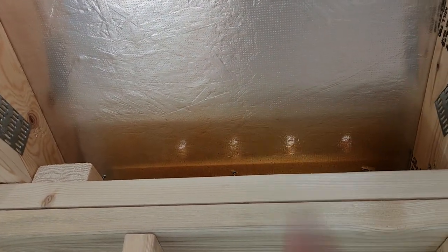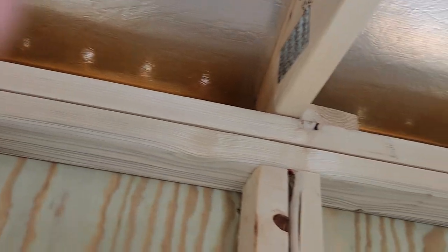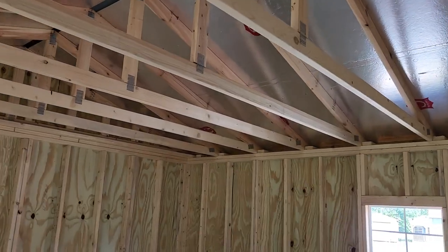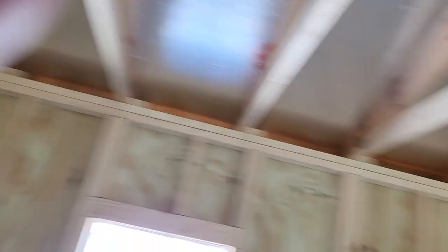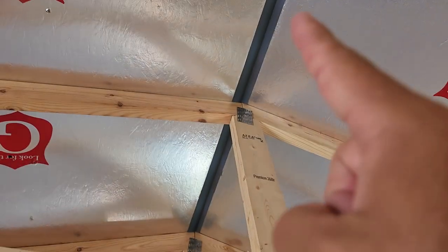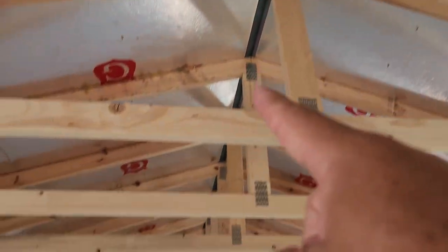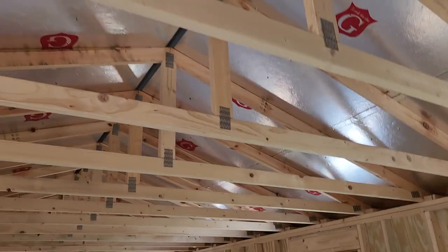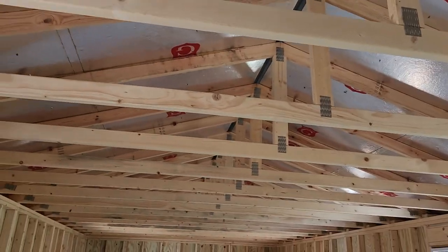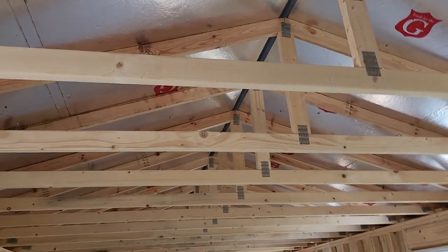I hope you can see a little bit of light peeking through right up there. That's our soffit ventilation system that I showed you when I was outside — it runs all along this side wall, all along that eave, and all along this eave. That's for improved airflow, and it's a Graceland patented exclusive. It works in conjunction with the screened-in ridge roof vent, which is screened to keep out bugs and debris, and together they keep the building 10 to 15 degrees cooler in the hot, humid, extreme summertime temperatures.